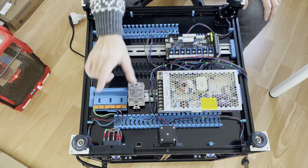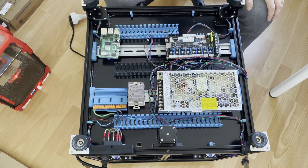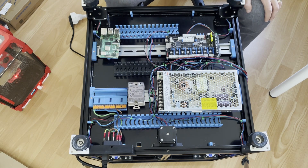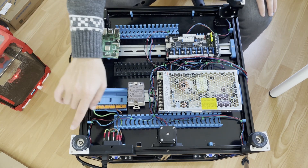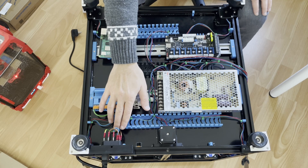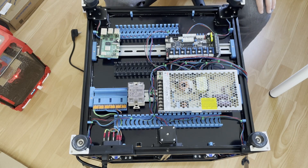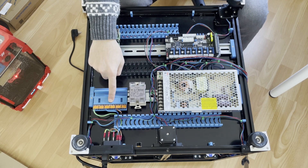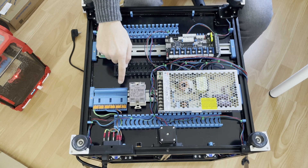Another important safety note: switching off the power switch is not enough for safety because as long as you're feeding the power skirt with the cable, there is voltage on the exposed pins and that can cause a dangerous situation. After testing, unplug your cable — that is the safe step. As long as your cable is plugged in there is voltage here, even with the switch off.